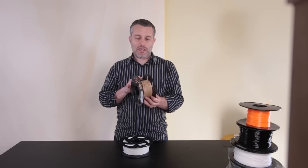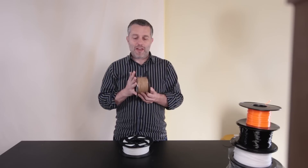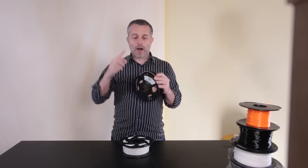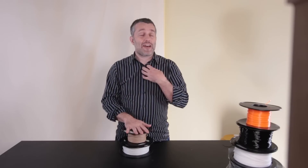The wood fill tends to have better layer adhesion. There's a video I'll link where they made a boat propeller and the wood fill ended up being the strongest of all the plastics tested — the roughness from the wood particles makes the layers bond a little better. PLA is fantastic filament and I've never had a problem with it soaking up water. What can happen is if your retraction distance is too high, you get an air bubble into the melt chamber, and when you unretract, you push that air bubble through first, making the classic snap, crackle, pop sounds from your nozzle.